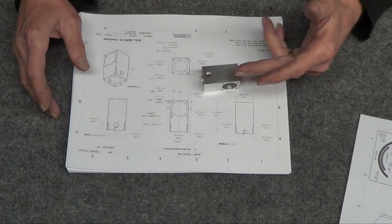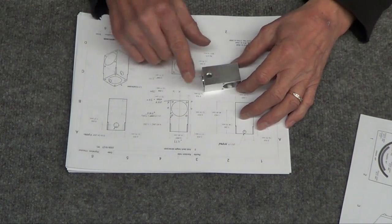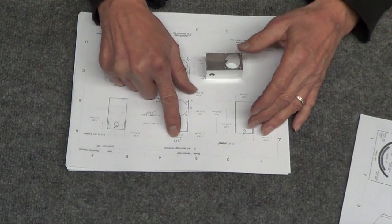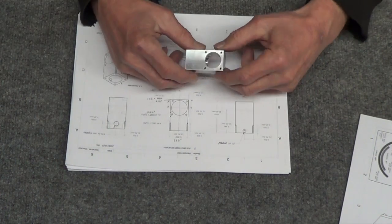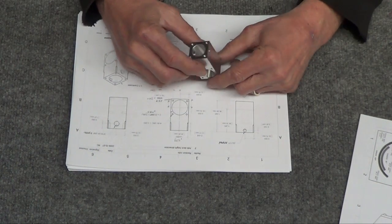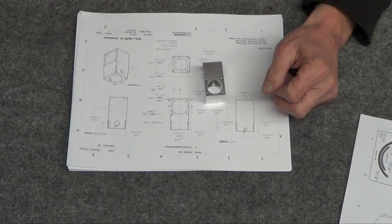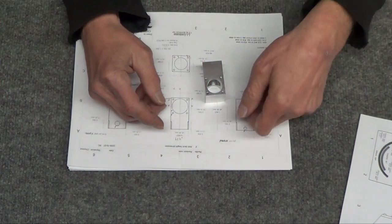So I just took a 1 inch piece of aluminum and fly cut the sides. They want 1 inch. I'm now down at 0.989, basically 11 thousandths skinnier. I don't think it's going to make a difference what the outside of the engine block or the crankcase really is.